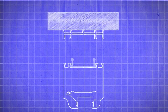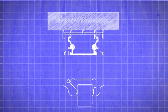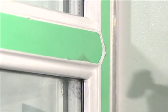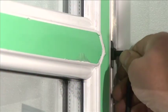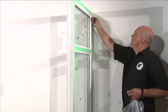Select the A129 wall plate adapter and two A128 wall plate connectors. Slide the adapter and connector downwards so it's held by the window's inner legs until it rests onto the sill. Slide the window and connectors along the sill to engage the legs of the connectors with the legs of the wall plate. Quarter-turn buttons should now be positioned between the panel and the wall connector, around 50mm from the top and bottom.